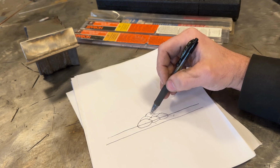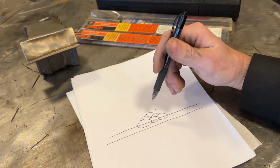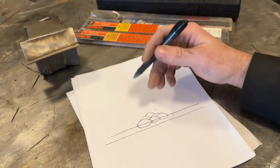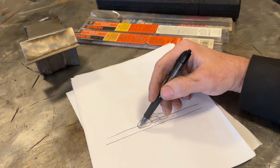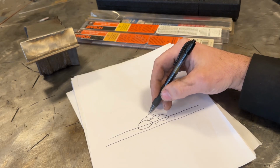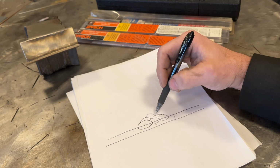And there becomes a threshold where it's so brittle, loses so much ductility, that when it's stressed, the weld just cracks. And it's very common, even during just cooling, that when you do multi-pass with a single pass rod, the weld will literally just crack off on its own during cooling. So that's the reason why you want to use a multi-pass capable build-up rod if you're doing build-up, because for multiple passes deep, it will successfully weld and not become overly brittle.